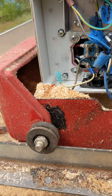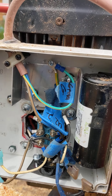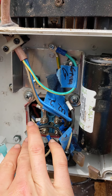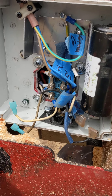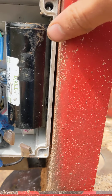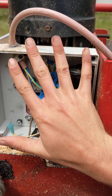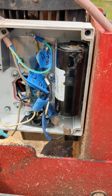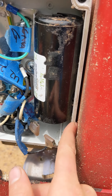That's one of the mistakes I made when building this box — something I would fix if I got a new enclosure. There should be template pieces made of aluminum that live with all the sawmill stuff, with these holes outlined so you can get that spacing exactly. Originally this box sat at a slight angle such that the bottom would touch when the motor was at lower tension, so I had to adjust the back plate to create a gap so the weight of the motor is not resting on the electrical box.